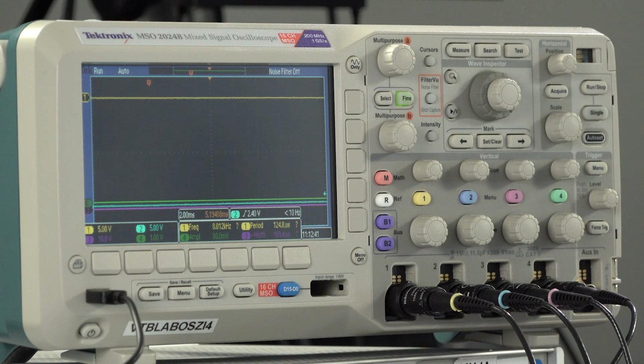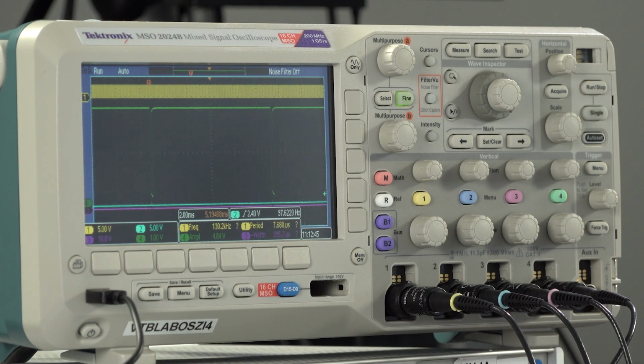So operation modes were selected and some default settings were defined. I can now power on the control board. The power supply is at 5 volt, and as soon as I make the electrical connection, the signals from the control board and the output of the iC-LFH become visible on the oscilloscope.